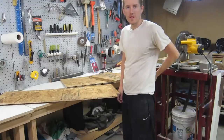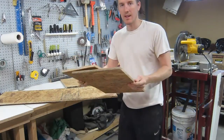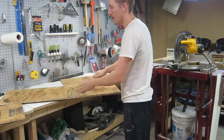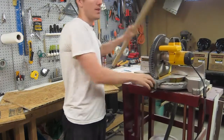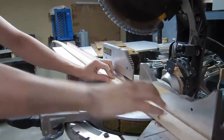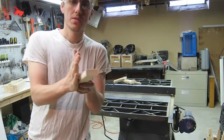I have all the pieces cut out on the table saw. Here's the top and bottom — 17.5 by 13. I have two sides at 41.25 by 13, and then the back. These are just 1x2s. I'll rip off the rounded edge that will glue to the side.